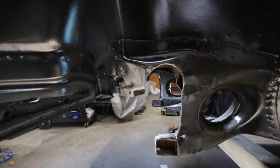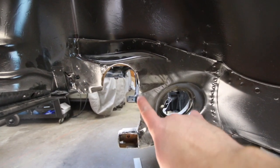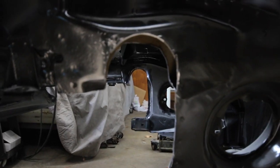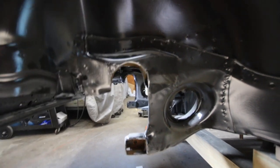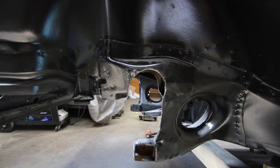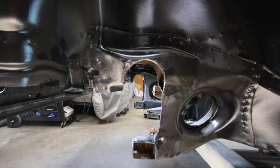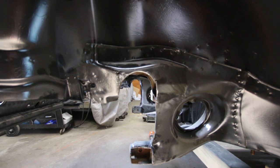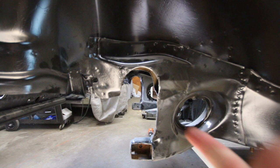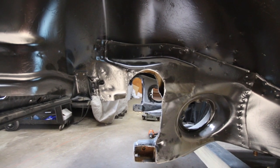I have the other one cut out as you can see — got it notched pretty good, you can kind of see all the way through to the other side. Both sides are done now. I need to make a bent piece of metal to fit in here — I'm just going to use sheet steel and bend it to fit. I thought about getting a piece of pipe to put in there, but I think it might just be easier to bend a piece of steel from a template. I'll make it big, put it up in there, tack it in place, and then cut it and weld the rest of the way in.